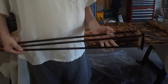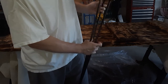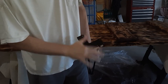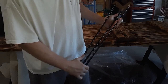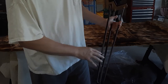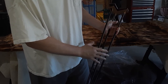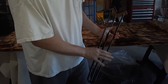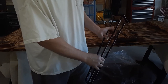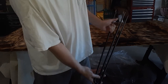Here are the legs we got. These are a three-rod design, and they're going to be anchored in underneath to the stiffeners I built under the table. These are in a shiny black powder coat finish and they're half-inch thick, so that should be plenty heavy-duty for this table. I've seen the three-eighths design on the internet, and maybe at a later time we may do some small end tables for some of the other chairs on the deck. These run about $75, shipped to the house. You can get these on Amazon, eBay, or various other sites. I'll put links at the end of the video in the description.